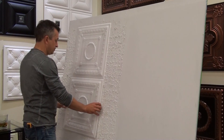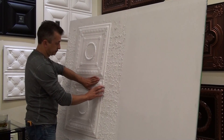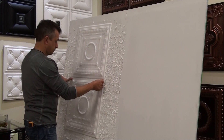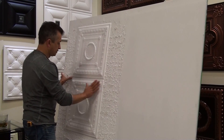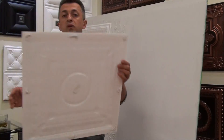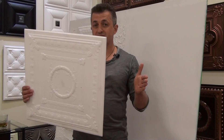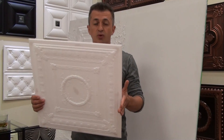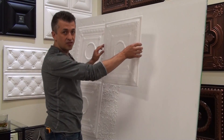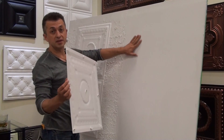Now applying the second tile. All the tiles have a bevel joint, which makes installation very easy — basically you just butt join them side by side. There is no overlapping and no spacing; you just put them together as tight as possible. Here you can see I'm going to cover part of the ceiling which is covered with popcorn, and another part which is a plain ceiling.